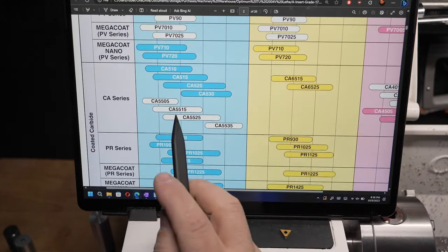And very surprising to find that the best finish was achieved with my old steel tool. In fact, the first one I made. And I think in future I will use these carbide ones for chewing into the materials, just removing stuff, maybe switch to that steel for the final one. Or if I need to sneak up onto a dimension, I'll use this TN60 one, that finishing one. I quite like that. It's very nice.